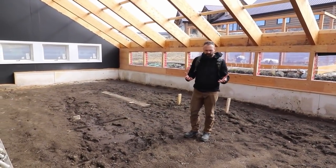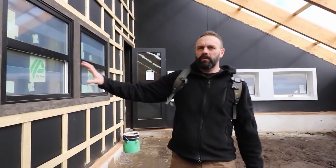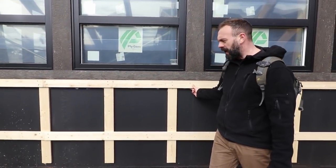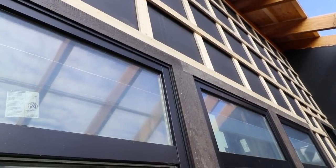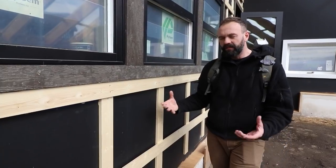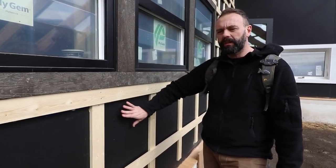If you've watched my past videos on greenhouses, you'll recognize this looks pretty similar to the greenhouse on our farm — it's about 800 square feet. So we're just getting ready to set up the solar wall right here. This wall has been strapped with one-by-one, with vertical and horizontal strapping. There will be a piece of expanded tin with perforations in it, similar to what's on my greenhouse at home, sitting right on top of this wood. The metal itself is going to be black, and as it gets hit with sunlight it's going to heat up. Because we've created an airspace in here, we have the ability to extract and vent the wall — extracting the thermal energy that gets picked up in the air in order to heat that air up. It also serves as a cooling function for the wall shared with the kitchen so that we don't overheat the kitchen.